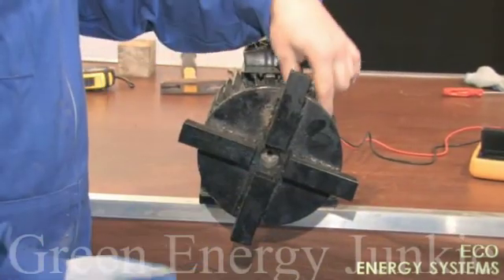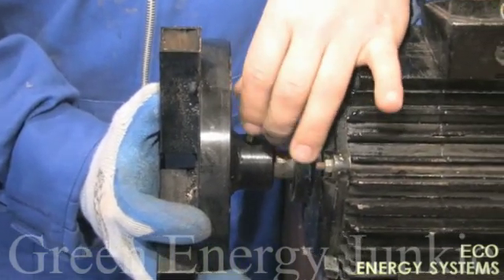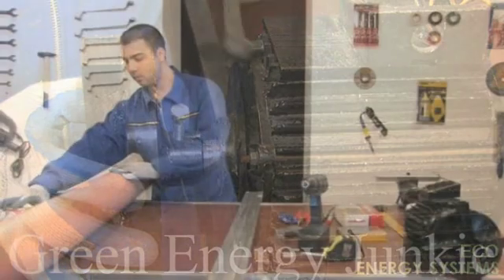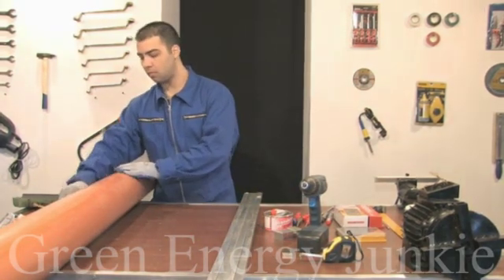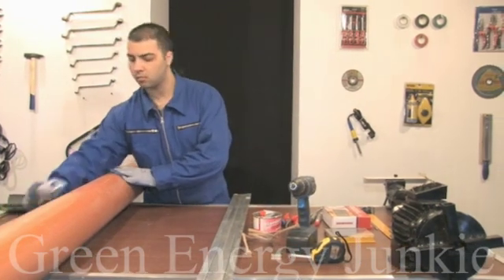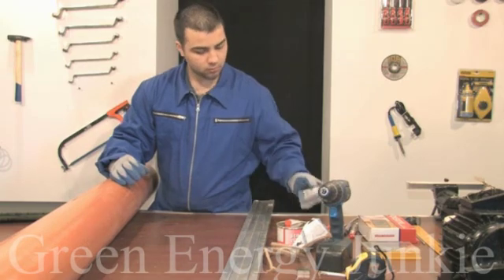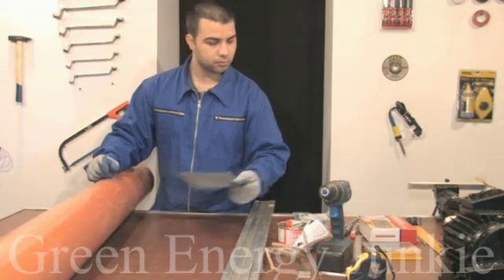As you can see, it's a hard piece of steel. I weld four steel profiles where the aluminum profile will fit and will be kept in place with screws. Tighten the screw that will keep the pulley in place. I'm going to use car reparation putty or bondo and hardener to fill the holes from the screws to improve the aerodynamics of our blades. Some self-drilling screws to attach the blades with the aluminum profile. Here we have a set of putty knives. If you don't have that, don't worry — you can use a piece of steel to mix the putty and spread it on top of the holes. Here I have sandpaper to smooth the putty after it's dried.